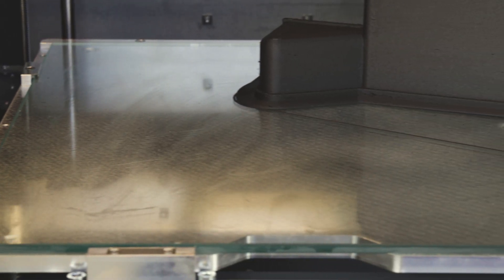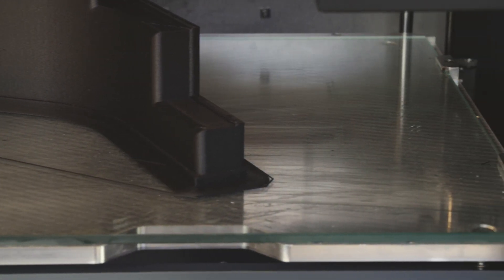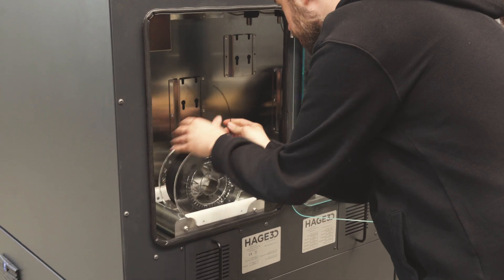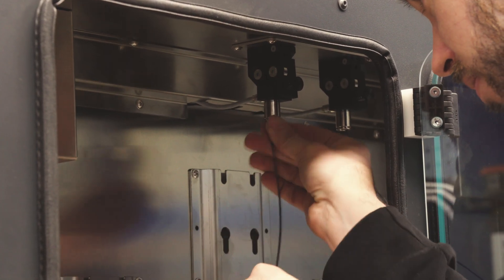Why is that? It is, as I said, a large printer which has a heated chamber of up to 100 degrees chamber temperature. The print bed temperature is up to 180 degrees. We have electric wiring integrated in the print bed so that heat distribution is very uniform. That means we can print from standard polymers like PLA, PETG, ABS, as technical polymers ASA, PC, and ending in PEI — some amorphous modified polymers which can really be used for high-performance applications where you need heat resistance of the printed part.